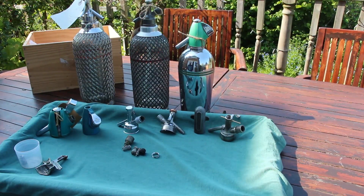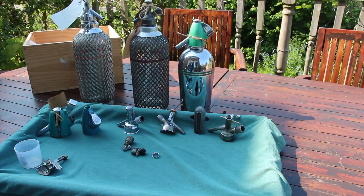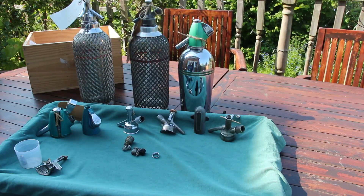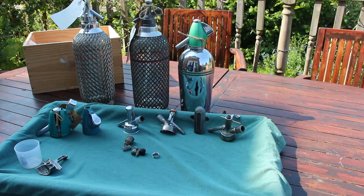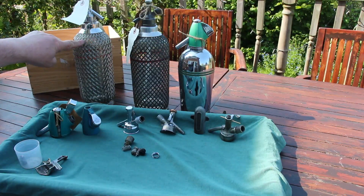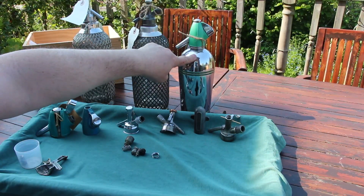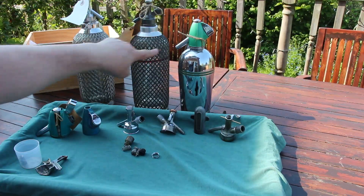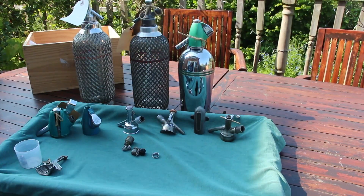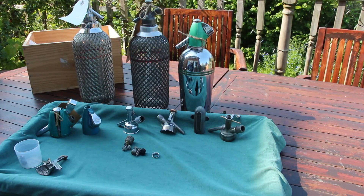Good afternoon, this is a video from Acris Pumante to discuss and explain some of the design features of the Type C, D and early Streamline models of soda siphons, all produced by Sparklets. This covers those made in the UK and some made in the US. Here we have a Type D siphon, a Type C siphon, and a Streamline from about the mid-30s to early 40s, which is the British Streamline because it has a chrome-plated spout. The American Streamline models generally had a plastic cover over the spout but were otherwise essentially identical in design.